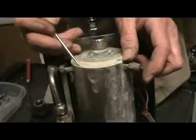And there's also something unusual for an Olympia machine. Right in here, there are some worrisome areas. Hold it still for a minute. There are some worrisome areas where usually that's a nicely soldered seam. So there might be some brazing that's going to have to be done. This leak, obviously a big leak, could be anywhere. So that's to find out down the road.